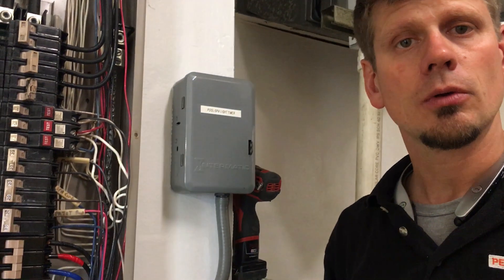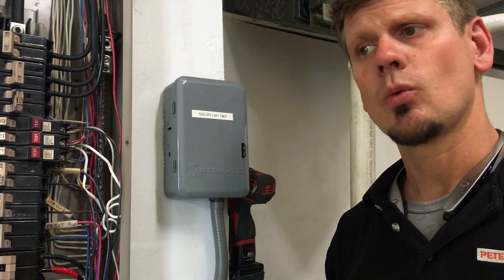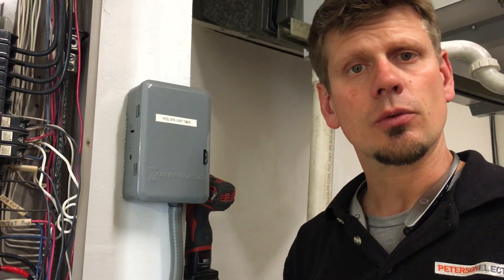Anyways guys, this is the way we kind of ran about that. Hopefully this video helps you out. Let me know about that hot water heater — I'm not sure why the manufacturer thought 30 amps on the fuses was good when we know we're at 43.3 amps for full load. Maybe that's because all elements won't kick on at once, since there are three elements in that large tank.